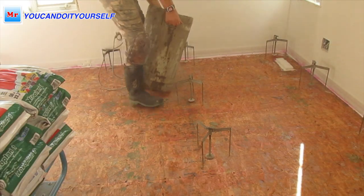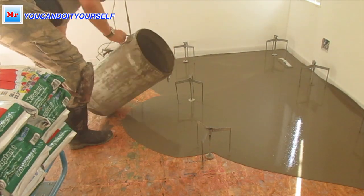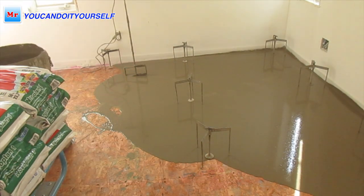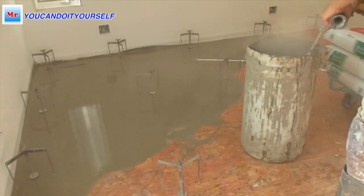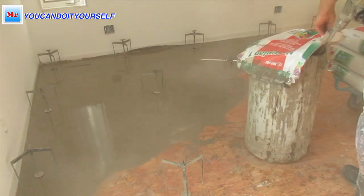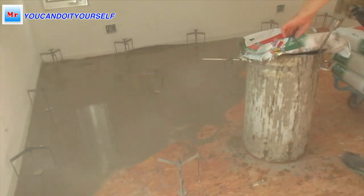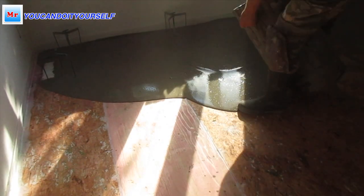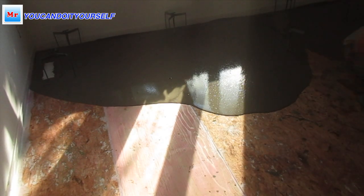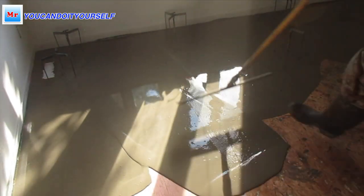In this video I don't show the full process of filling with foam. On the right corner you'll see white foam covering the vent. I also put foam along the walls and applied caulk at the bottom of the foam to avoid any leaks downstairs. This foam also gives you an expansion gap so when the self-leveling compound dries it doesn't transmit sound from the floor to the walls.